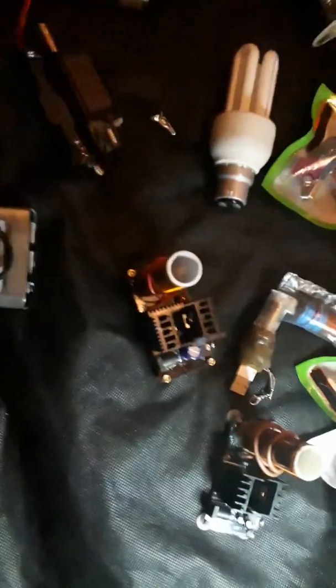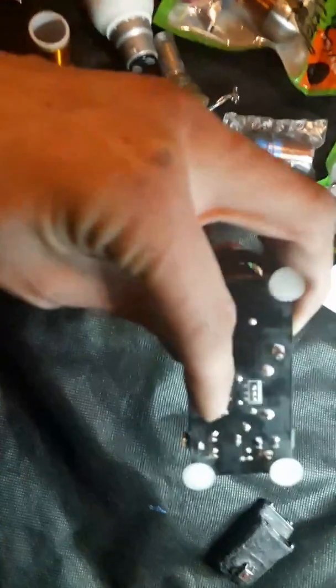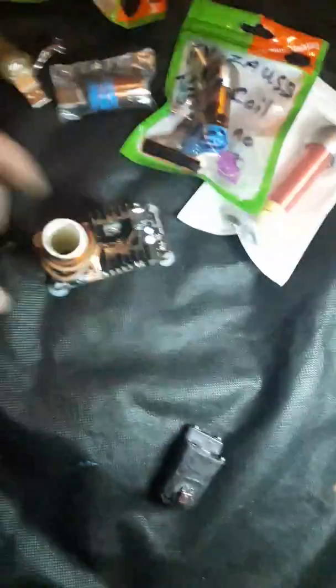While I'm on this video, I'll just quickly show some of the projects. These two — I bought these as parts. That one's off Wish, that one's off eBay. It turns out they've got pretty much the same ones. I've added one of them in, so I've got two of them. The wire on this was really tight so I've put my own on it. They both play music. A little thing for people to know: if you get G and D and solder the two points together, the arc will get bigger and it won't play music anymore, but you get a bigger arc. I've actually heat-sinked this one up a bit more. I do have a fan that fits on there sometimes, but I keep popping them because the fans are 12 volts and I'm powering these up to 24 volts.